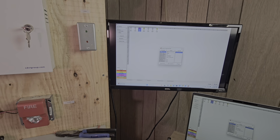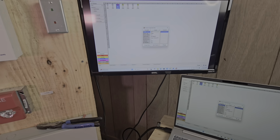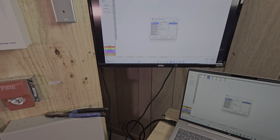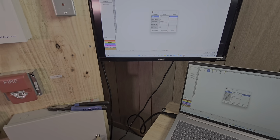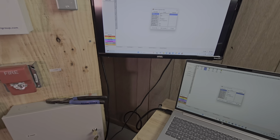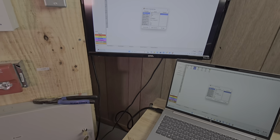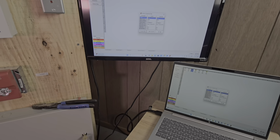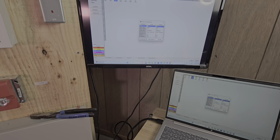And then we're going to select the actual, because there are 2 expectancies, right? So we have what we have actually and what we have expected. If you pre-program this, the system is going to be expecting certain devices. If you don't pre-program it and you bring devices in, that's what's actually there. So you click on accept actual, so that it can create an instance and create this actual device on that actual address.